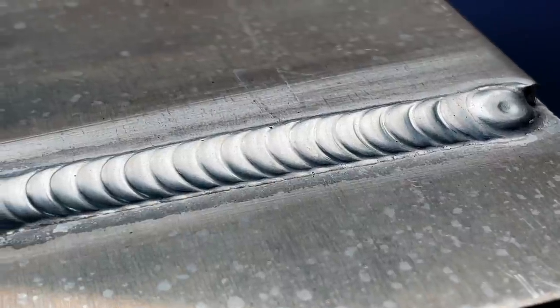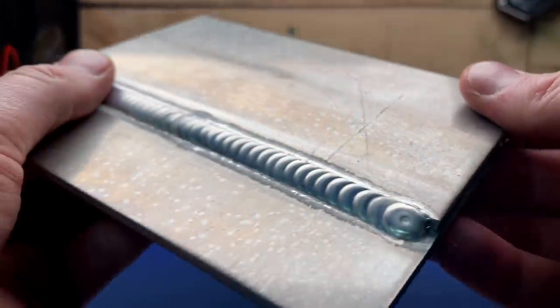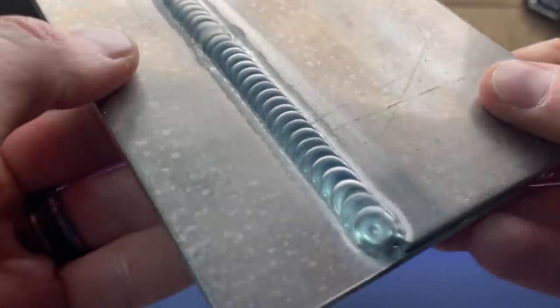Here's a redemption lap weld — this one looks awesome. Nice, clean, straight edges, and our filler material has blended out and taken perfect shape with the base plate. Now taking a look at all these details that we liked, what are some of the things that could have contributed to this? Take a look at the start — do you see how these have blended in right away, both at the start at the beginning and the stop-start in the middle? One of the biggest things I keep emphasizing on my YouTube channel is to focus and pay extra attention to our starts. In my program, we actually spend time specifically working on only our starts. This is a way to properly get up off the ground with each weld, and once we get up off the ground and start running with it, we can maintain this easily as we move along.